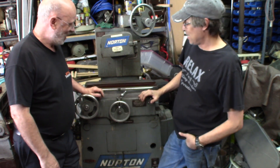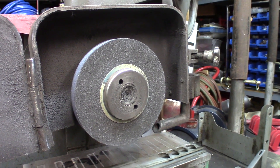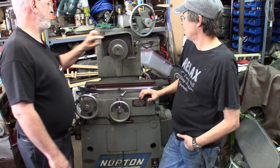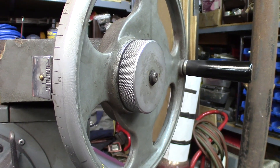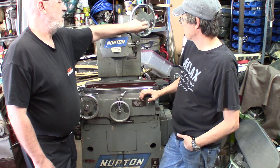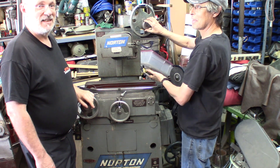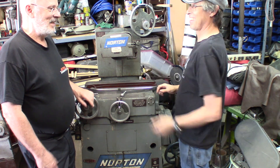It's a two-ton beast with 8-inch wheels, and with it I got a provision of wheels for the next 30 years. It has a coolant facility. The wheel feed has very large numerals with wide spacing — about half a thousandth per division — and also a little vernier scale that gives you one tenth per division. Rough adjust, vernier, and fine adjust. I'll show you that closer.